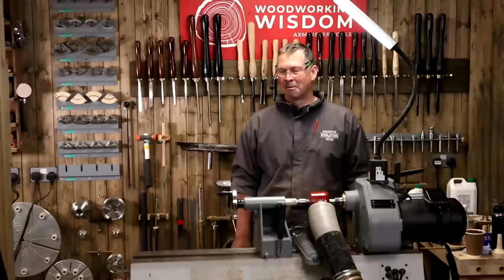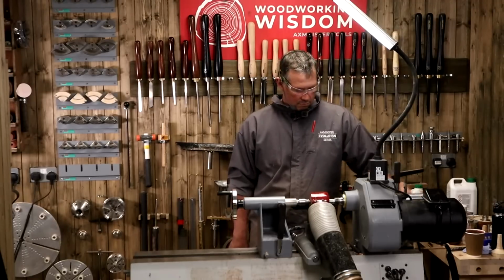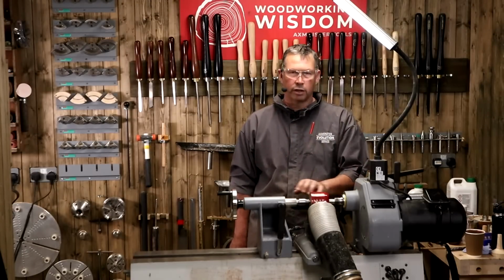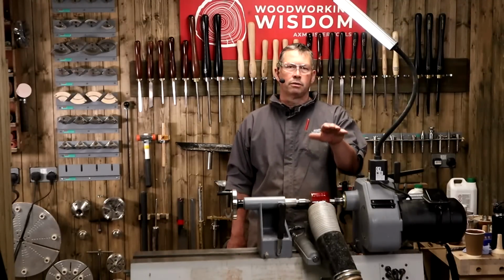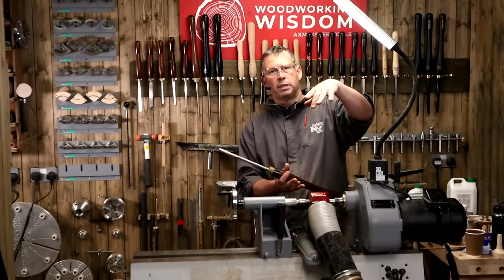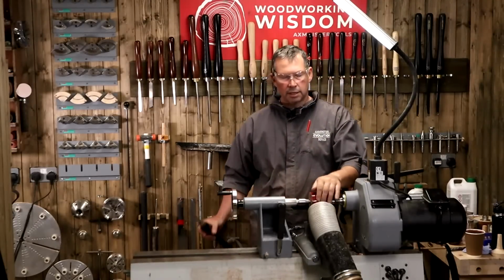So, Colwin, just a quick one here from Michael. It just says, do you increase the speed for harder woods? No. Don't do that. There's been a lot on social media lately and forums about lathe speeds, and I ignore all of it. I never want to look at a chart that gives me a lathe speed, because I feel that's very dangerous. Because one bowl blank is completely different to the next bowl blank. If you had a piece of balsa wood as a 12x3 bowl blank, then you had a piece of ironwood as a 12x3 bowl blank, they are different beasts, and different timbers act in different ways.